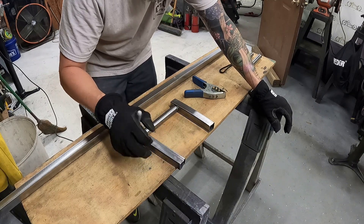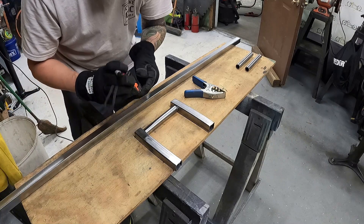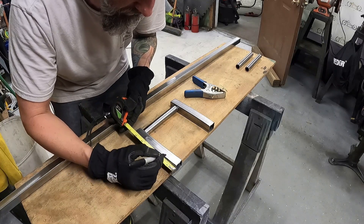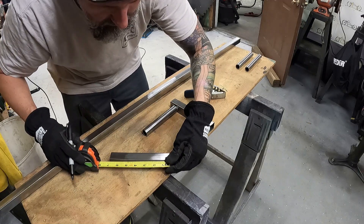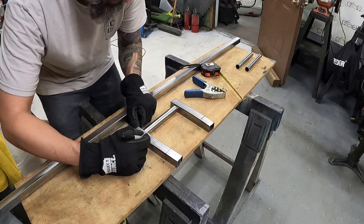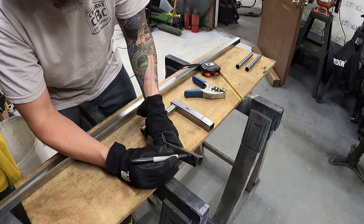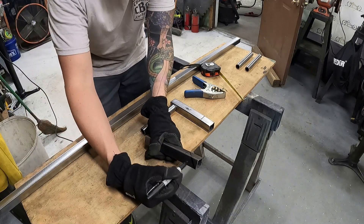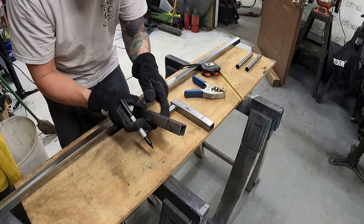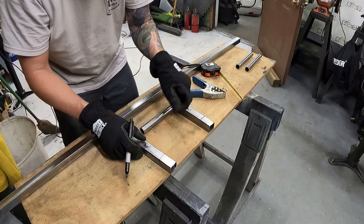You want to cut it at an angle, and depending on how much angle you give here is how much that bar is going to lean forward. The less angle you give it, the less you have to lean it. You can use a chop saw, or just use a measuring tape. I'm going to come down an inch and a half off the top of each one. I'll do a line on this one and then come over here, label them so I know the face. Start in your corner — this is not an exact science. You can measure from here to here and find your center, but I'm just eyeballing it because I'll lay them next to each other and grind them together. Go across there and that's my cut — same with this one.